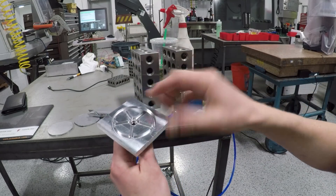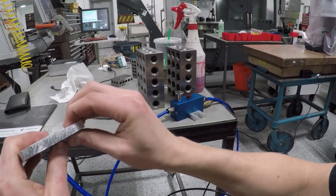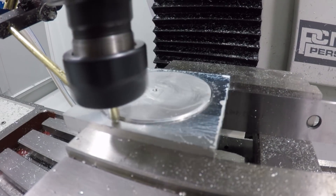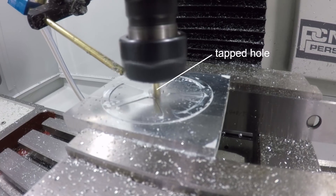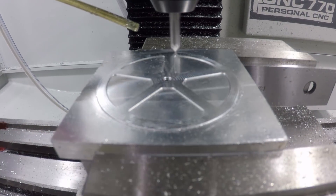Ultimately, it failed — the vacuum just didn't work, we didn't have enough surface area. We instead realized that the final part had a tapped hole in the center hub, so we used that tapped hole in the fixture. You could have also used super glue, but this vacuum-through-fixture technique is still a great technique that absolutely can work and is worth keeping in your toolbox.